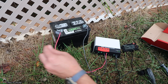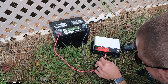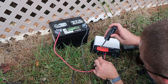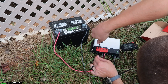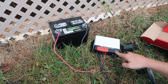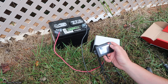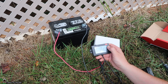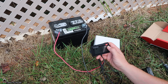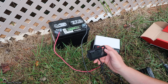So let's go ahead and plug up the solar panel. I've got my positive here and negative here. Let's go negative first, and then positive over here. The light is blinking, showing that there is input from the solar. We've got 16.5 volts coming in from solar right now, 1.59 amps, and it says 22 watts coming in. We'll wait for the sun to come back out and see what this value goes up to.